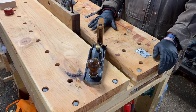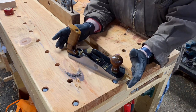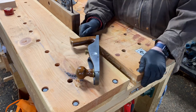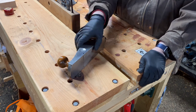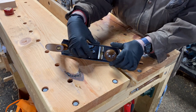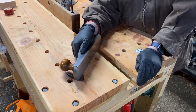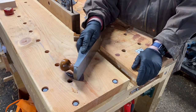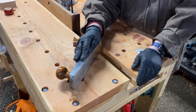As you can see, it's a very simple plane and very easy to use. The body and the base are perfectly square, so it works as a shooting plane. The design of the lever cap allows you to place your fingers in there and your thumb on top, giving you a very positive, non-painful grip on the plane. Or you can use it with your fingers in the little divot on the side.